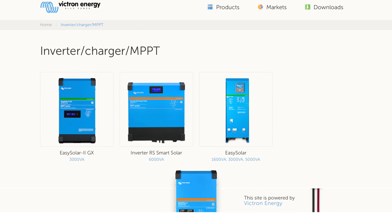So you might wonder about the inverter and the inverter charging along with the controllers charging. And you're right, that can cause not problems, but it might just confuse things. What I do is I just let solar charge the batteries now completely. I turned the charger on our inverter off because we're always getting plenty of voltage from the sun to charge the batteries, and I don't need those two things competing. I do plan on upgrading to a Victron inverter soon. We'll talk about that in a minute.